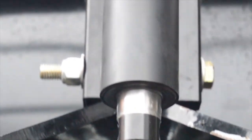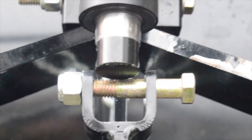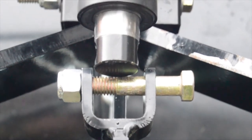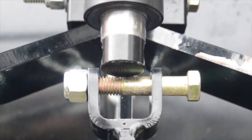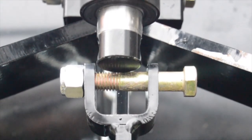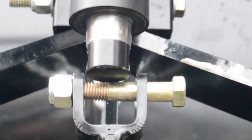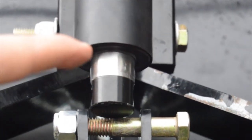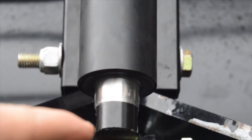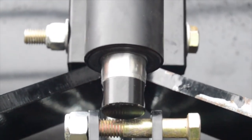So the motor here, the extension arm on the worm drive motor, came to me too short to actually be able to put the bolt through it. So now I come to a major issue. I can't actually articulate this thing. I've got to get it mounted up, get all the electronics mounted up, before I even see if that fits. I suspect it will, but again, there needs to be some type of measurement from the bottom of the outer sleeve here to the center of that hole, that somebody at the factory needs to be checking to make sure that you can actually bolt it up.